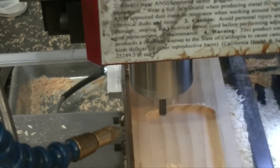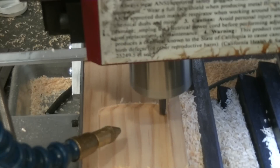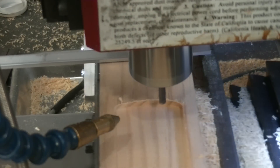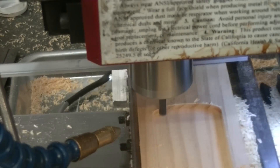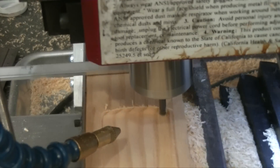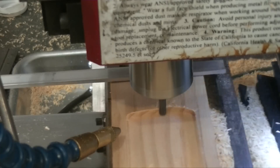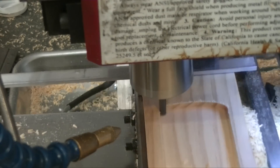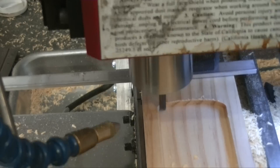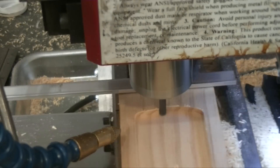All of it's going to get sanded anyway — the edges need to get sanded, classic deburring kind of situation if this were metal. I used the Noga misting setup, but I turned the fluid off. All I did was use air to keep the chips out of there and keep it from loading up. It wasn't having any problems cutting, but you couldn't really see what it was doing without the air blowing chips away. Made an almighty mess, but it worked. I had ten of these to do and it worked out really well — I was able to just blast through this.